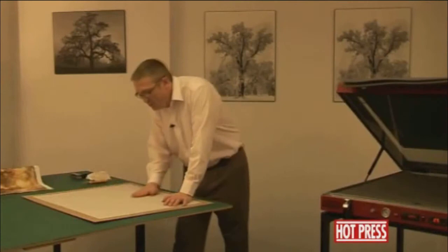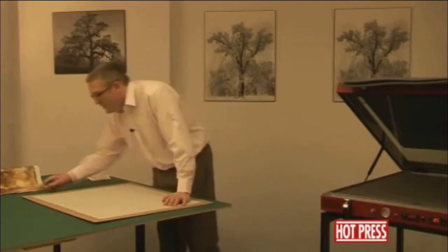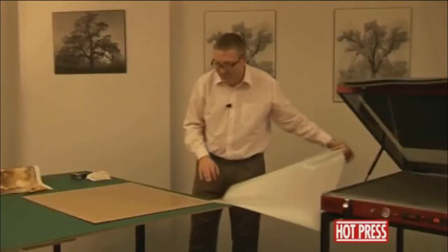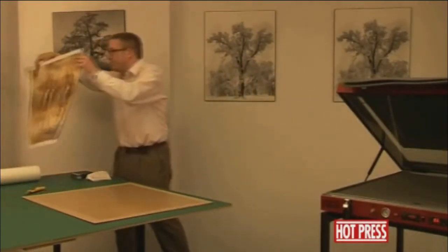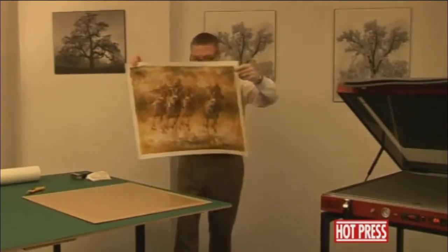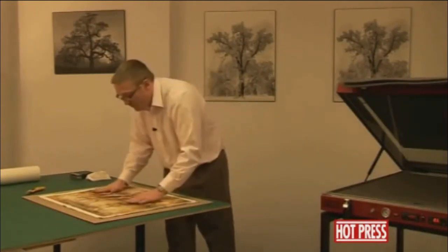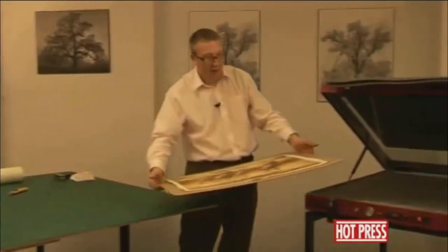So we've now processed this in the press, so this is now a pre-coated board. It has the second sheet of silicone release paper on top, so we need to remove that. So we'll just dig a knife into the release liner, lift it up. You'll notice that the adhesive is then stuck down onto the board. We can take that piece of silicone release paper away, throw that out of the way. Take your print, making sure that there's no loose pieces of cotton that are stuck over the back. We can then lay that down, making sure that it's level with the film. Okay. This can then go into the press.